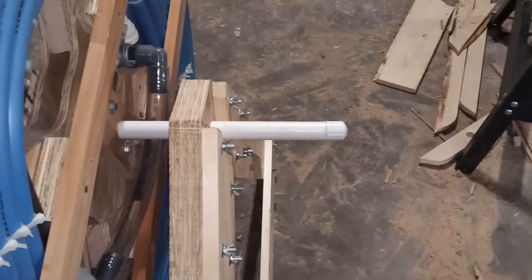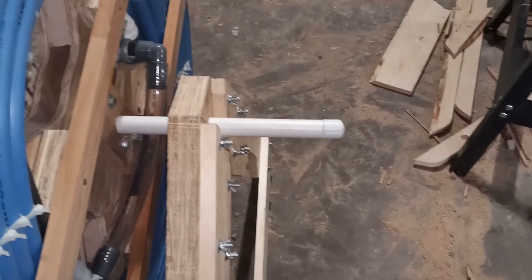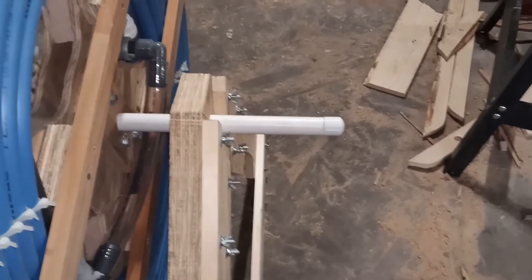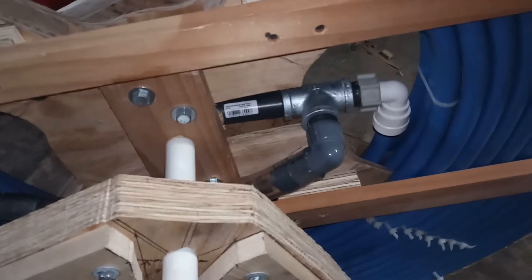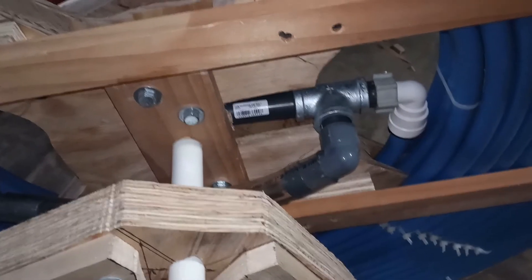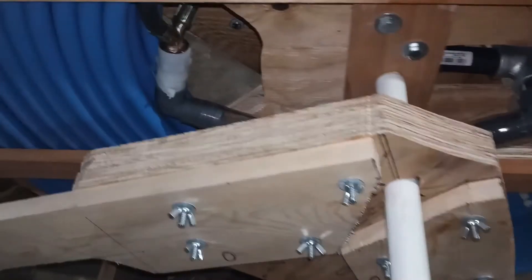I'm going to change the plastic PVC fitting to a metal one — brass, I think — so that we can resist corrosion and water issues. We've got water running through this, and if we're going to pull it out and filter later, we don't want to add debris problems. I already have some galvanized pipe, but mostly plastic. You can see there are two galvanized T's, and I'm going to be coating the outside so it won't rust. I'm expecting some leaks when we first start up, but I'm ready to patch them.